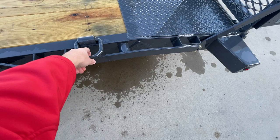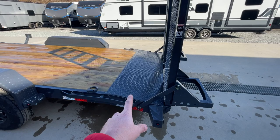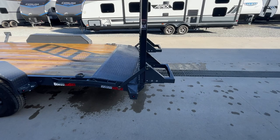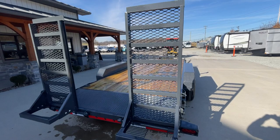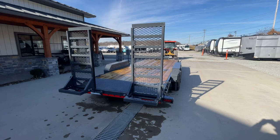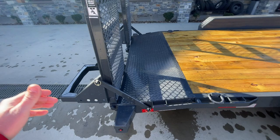You have additional tie downs to the rear of the trailer — behind the axle you've got rub rails, stake pockets, chain spool, and optional tie downs. One thing you don't always see on equipment trailers is a gusseted beaver tail at the back, which is fairly uncommon. This also has a tread plate beaver tail instead of wood, which tends to be more durable. Some folks use winches and this makes it easier to get stuff up on it. These are called deluxe ramps — they're wider with a heavier mesh face, allowing you to load items more easily.